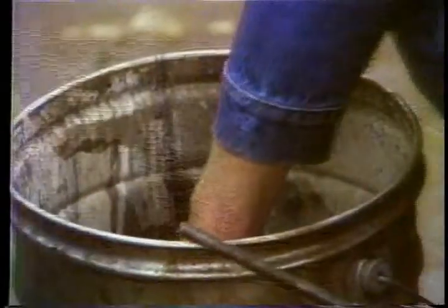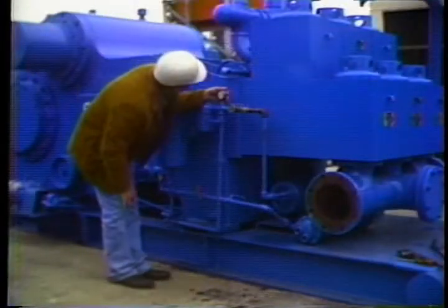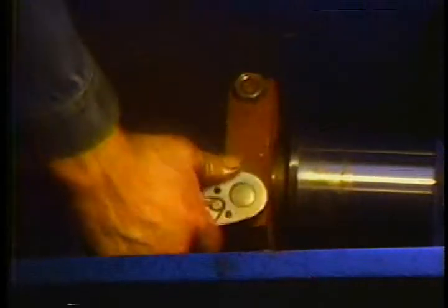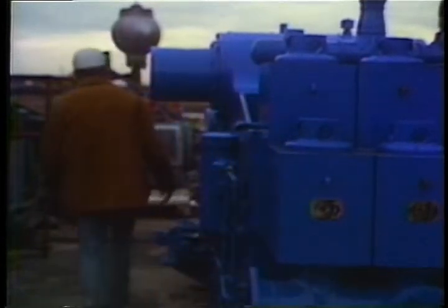Start the oil pump five minutes before you turn on the main pump. Don't forget to clean the breather cap. Make sure the oil temperature is in the proper range — between 70 and 160 degrees Fahrenheit — before you start the mud pump. Then start the charging pump and your mud pump and circulate mud to the pits for several minutes. Be sure to watch the pressure gauges to make sure that oil is circulating. Now stop the pump and let the oil settle for a few minutes. Recheck the extension rod clamps for tightness, then check the oil level and add or drain some oil if you find it necessary. You've taken pretty good care of that pump — now she's back in business and she'll serve you well.